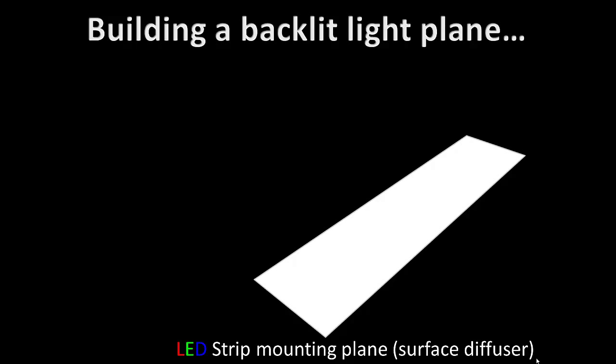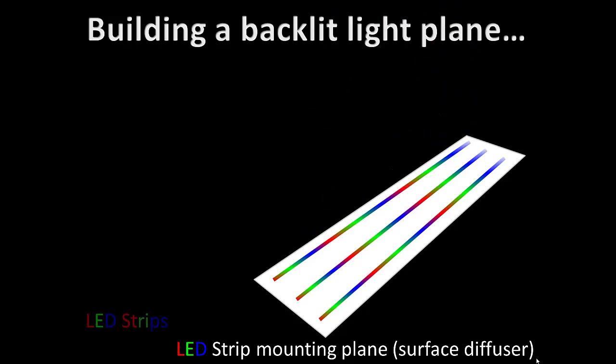So far all that I've shown in my examples is plywood painted matte white with ordinary latex paint. But later you'll see surfaces where I used projector screen material, which gives much better surface diffusion. This material can be purchased very inexpensively off eBay — some people call it blackout sheet or blackout material, but it's projector screen material. It's extremely flat white with a rubbery substrate. You can cut it and glue it with contact cement on your rear surface, though you don't need it for an aperture diffuser.